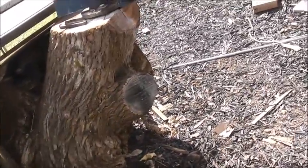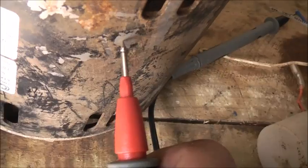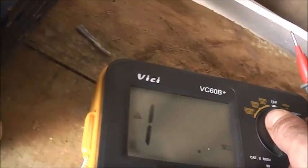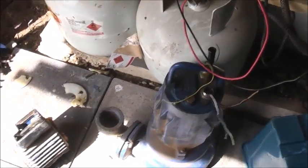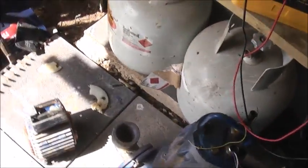Whiskers was chasing a little gecko. I'm getting the tiniest spark off the body of the motor between any one of these wires - except the earth, obviously. Yep, gone - it's gone to ground. Oh well - parted out, scrap it. That's also gone to ground, I just tested that too. That one's gone to ground as well. The stone bolts are still in on it, so now we're going to come off and just part it all out and chuck it straight back in the scrap bin.